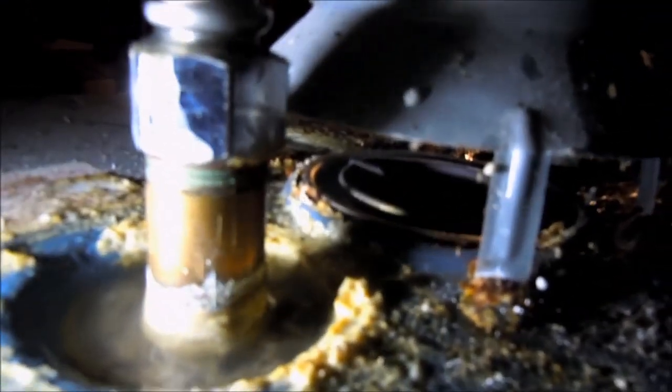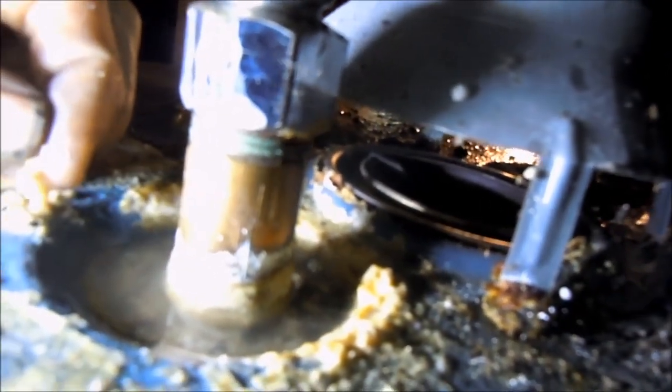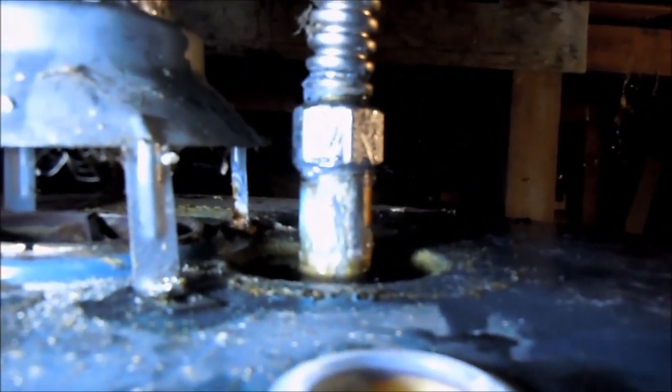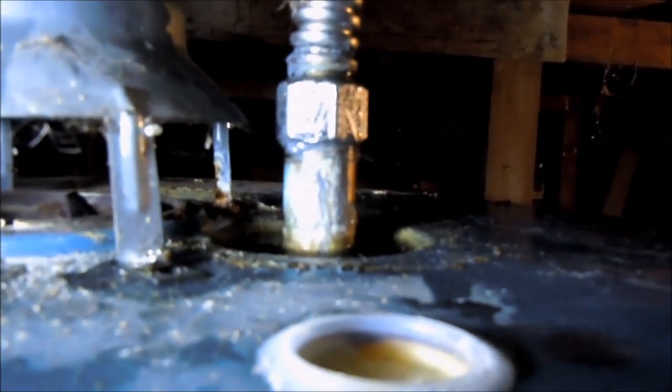This one here I'm not gonna mess with — it's not filling up too fast or anything. You see all this corrosion: the fluoride, chlorine, and minerals make this toxic brew right here. Oh, there's your anode — that thing doesn't look too good. I can't remember, it must have been several years. This has never been changed. You couldn't change this thing here very easily either — you'd have to disconnect the whole damn thing. Looks pretty crusty. At least this part here, which is what I originally saw, is not leaking.